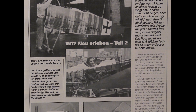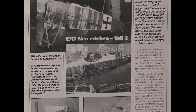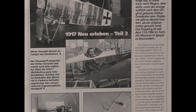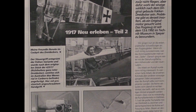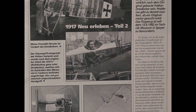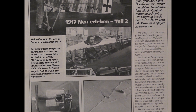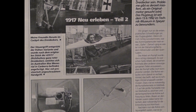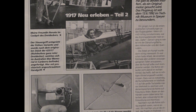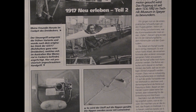The work on the fuselage then became really interesting. It was already hard work fitting the individual tube parts to all the other previous parts, but the fuselage was to become even more complicated. The tubes do not run at right angles anywhere, which means that they have to be fitted at the right angle. It was necessary to draw the fuselage sides at one-to-one scale on the large tabletop in my workshop and file the tubes to fit accordingly.